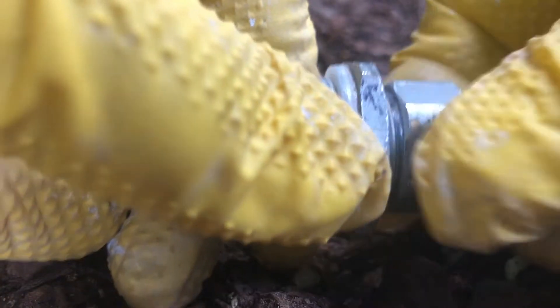My recommendation is at least three wraps. The packing presses down inside the nut and against the other threaded fixture, mashing them together and sealing around the shaft so it doesn't leak.